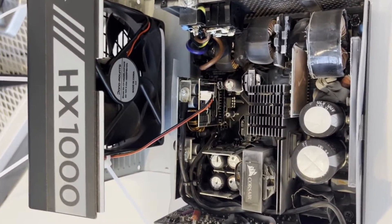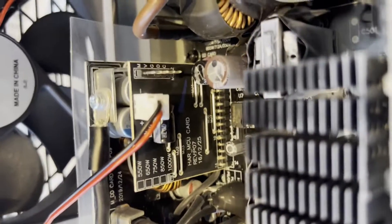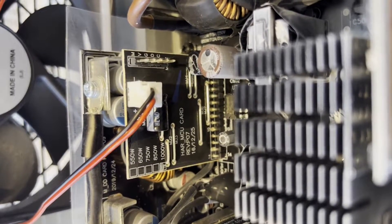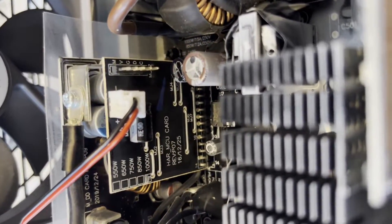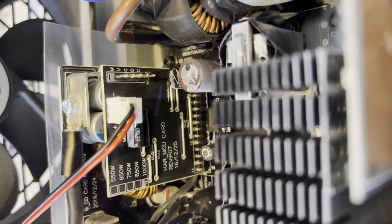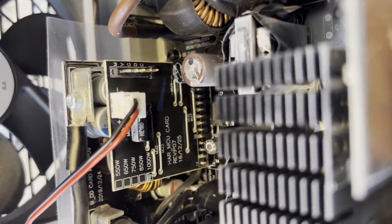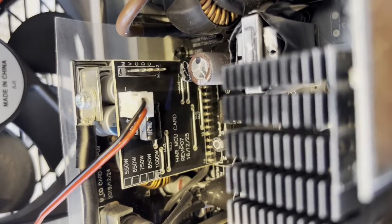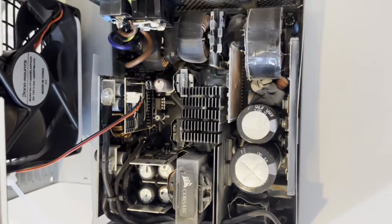I also want to point out that not only are the wires color-coded for the 2-pin 12-volt DC fan cables, but there's also a plus and minus label to further verify you're plugging the correct terminals into the correct sockets. The fan provider I'll link in the description has them in the correct order and includes a schematic showing which is the positive and negative terminal — always good practice to double-check, especially when working with a power supply unit.